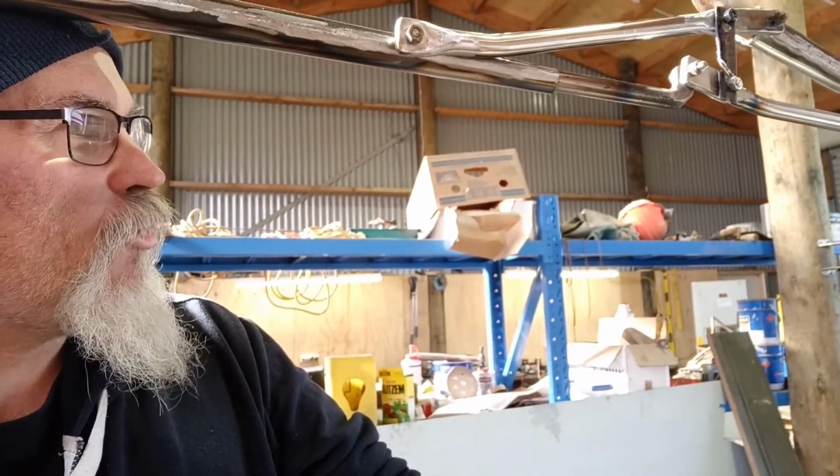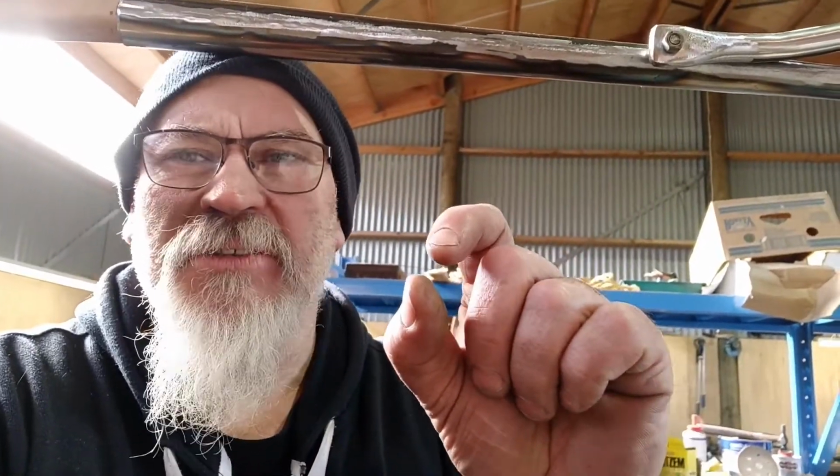Yeah, I'll call it here for today. That should be the end of this video, I think. Hopefully we might have come up with a plan for this timber. I think we're going to laminate, but maybe with slightly thicker stuff, and obviously sweat it or steam it so it's a bit more flexible. Hopefully we can get a decent result. See if we can get two different directions in one hit, and then carve it down. I think we're going to go for about 3/8 or 10mm. This was 4, so we're going to make it slightly more than double.